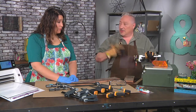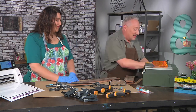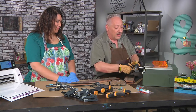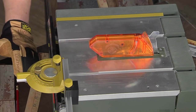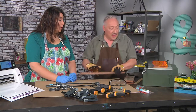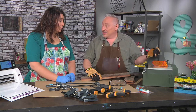Why? Because you're more likely to get a kickback. Okay, well that would be bad. So we're just going to take that fence off. I am going to use a guide though, a combination of a pusher and a guide. A cross cut is obviously you're cutting across the grain of the wood. So we're going to go this way, and I'm just going to cut the two sides. Now what's cool is that this is connected to a vacuum, so it's going to extract all the sawdust, or a big part of it.